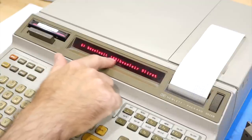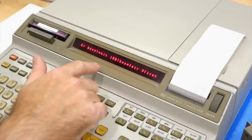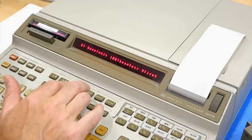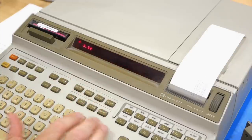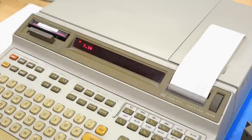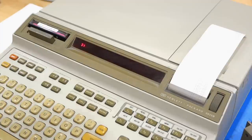I have to put a little wait statement in there — which is not ideal in an interrupt routine because it hangs the machine — so when it does a two-beep, you'll see the count stutter a little. For simplicity, that's what I chose to do. You'll hear the double beeps at a completely different period than the first one, so you can have up to four completely different periods to generate interrupts. Not bad for a small calculator.